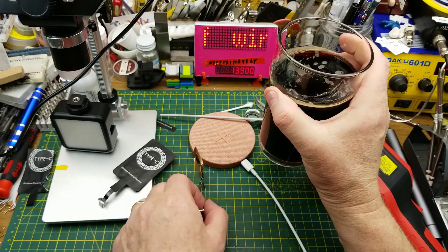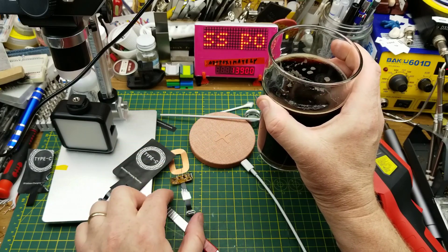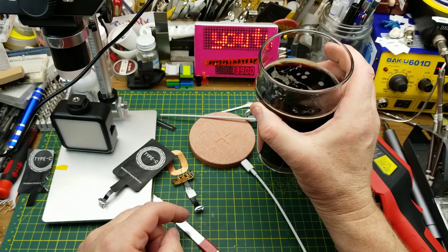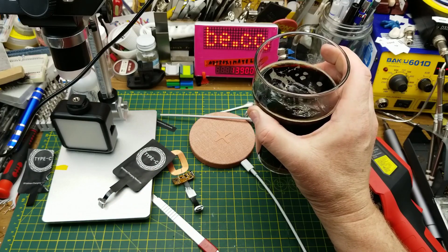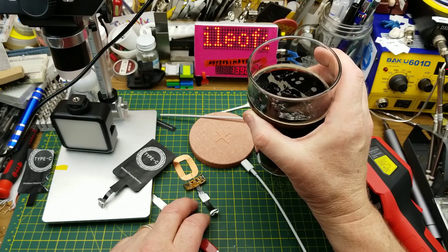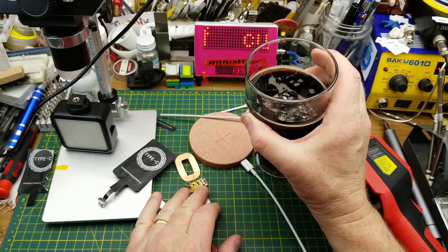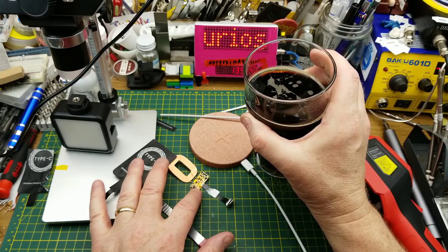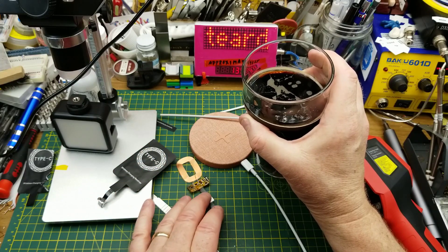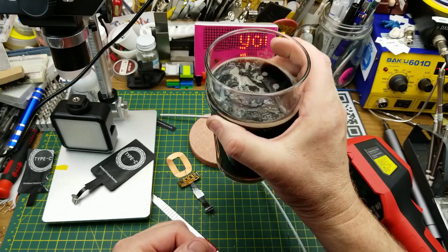That was an interesting little teardown. Unfortunately, based on how obscure some of these markings and components are, I couldn't get too close to figuring them out. I'll do some more research afterwards and if I find anything that makes more sense I'll throw it in the description, but I'm not holding my breath — even people much more experienced with surface mount than me have a lot of trouble finding these things. I found out what I needed to: this thing is probably beyond repair. At least that one little proprietary chip is toast, those two Schottky diodes are toast, and who knows what else is damaged. Anyway, thanks for watching — questions and comments down below as usual.